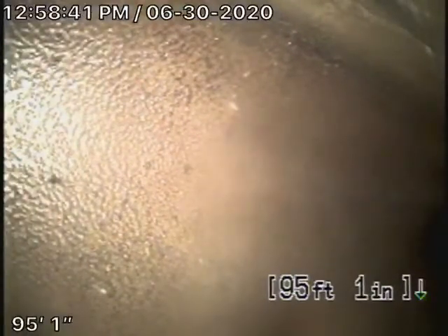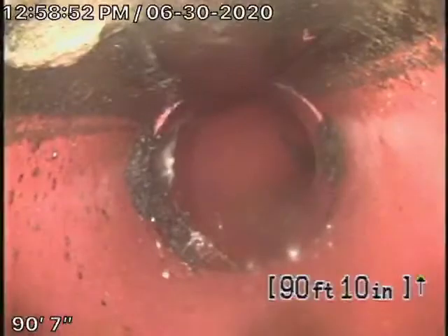We're right now at the city connection in the street. There's the city sewer flowing by, and here's your connection to the city. There's a clay pipe with a little bit of roots coming in at the end — minor roots in a big 6-inch pipe. A little bit of roots coming in over here as well.